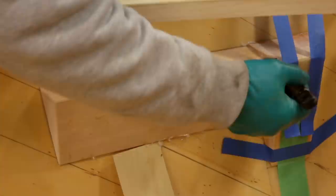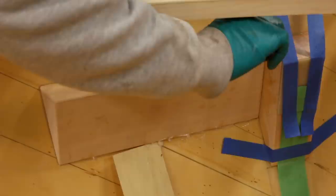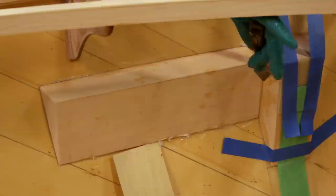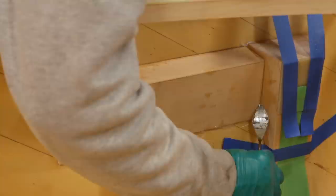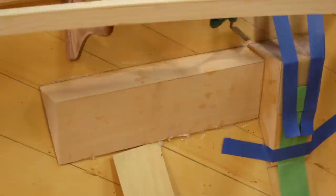General rules: scrape up before you tool down, meaning using a forward motion with my tool in order to get rid of excess material before I use a dragging motion to clean up that joint. Of course, if you want a very clean joint, you don't use a dragging motion at all, you just tool it up and get out of there. But I don't mind the idea of a little tiny fillet in these joints.